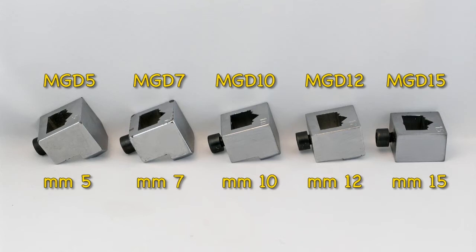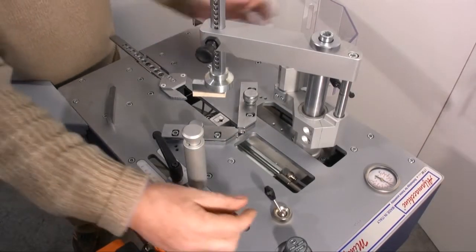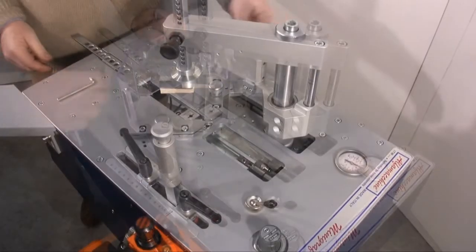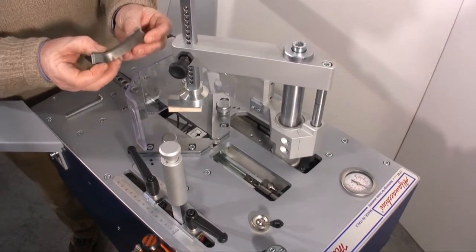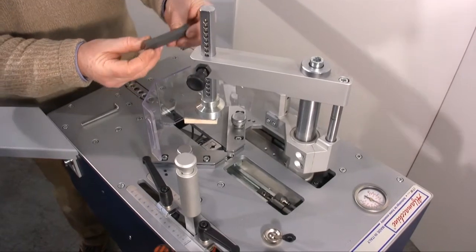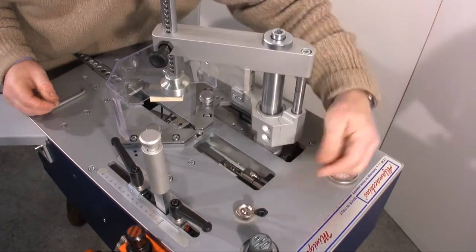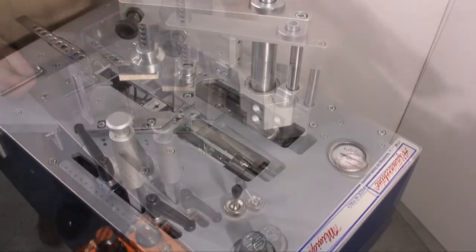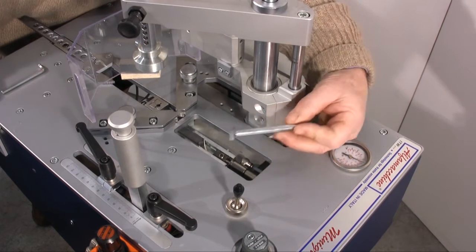A different head corresponds to the different wedge heights. The head regulates the upwards push of the wedge. Before inserting the stick of wedges you have to detach the lever which pushes the wedges forwards. When you insert the stick of wedges you have to make sure that the sharpened side is facing upwards. The sharpened side is the one covered with glue. After having inserted them you have to move the small lever which pushes the wedges forwards.